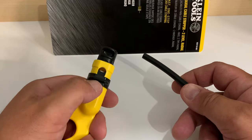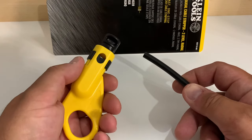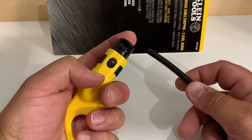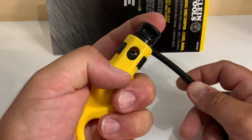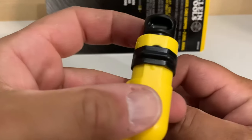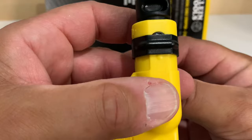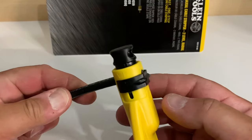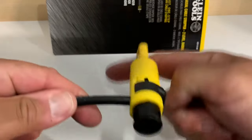To strip the cable, the first step is to use your thumb to slide this depth gauge over — what that does is provide a positive stop for the cable, setting the cutting depth correctly. Now with your index finger, press this plunger down. You can see that opens up the hole and the cable slides in all the way. The depth stop sets the cable to the right cutting depth. It doesn't matter whether you're using RG-6 or RG-6 quad — the plunger will automatically set the depth for you.